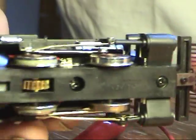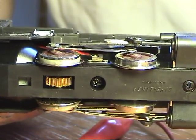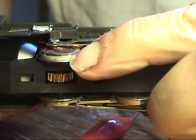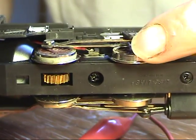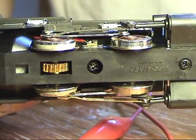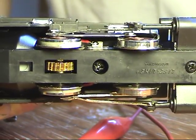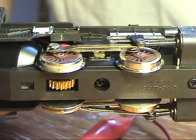I have it on this little switcher here — even though there are pickups on these two wheels, this wheel has traction tires which won't get a pickup from the tracks very well at all. The way this little train was running, it would be very jerky and jumpy. Any dirty spot, any plastic or dead frogs — it would stop, it would jerk, it just wouldn't run very well. So we're going to put the super capacitor in this one.